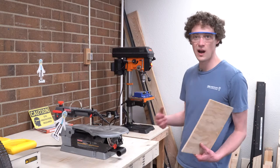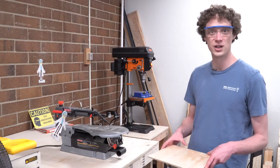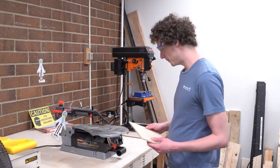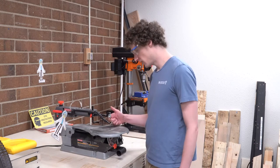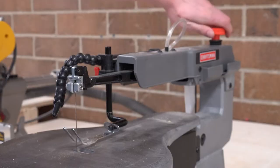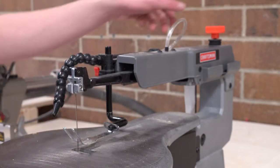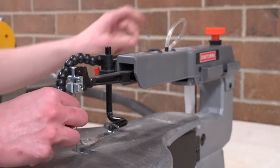So first let's get into how you're going to set up the scroll saw, and then I'll show you how to approach a cut. Before you make any cuts, you want to make sure the machine is all set up. One of the very first things you want to do is make sure that the blade is tight. There's a little knob back here — if you untighten it, it allows you to change the blade, but you want to make sure that when you're cutting it's not loose at all. Definitely check this before you do anything else; make sure the blade is really tight in there.